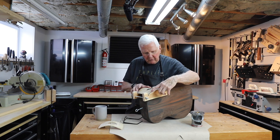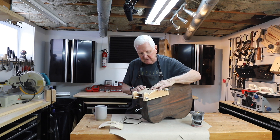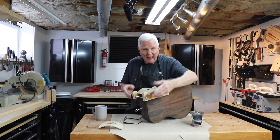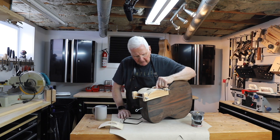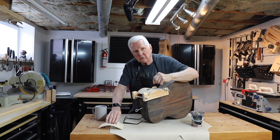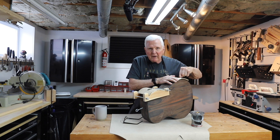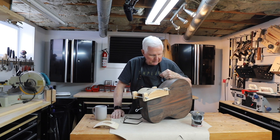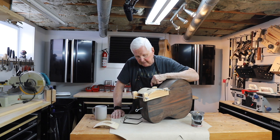So these have got four screws in here and slots on the side, so this thing will slide this way or that way to line up and center up. Now remember the guitar tapers, so what the threaded rod does is it allows me to angle this thing or bring it out — whatever I need to do. The key here is to get this oval down as close to the body of the guitar as I possibly can so that when the router is running around here I get a good straight cut, because later on I'm going to show you another little thing about how we're going to bind that.